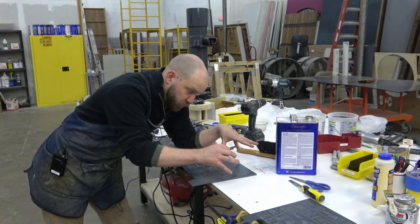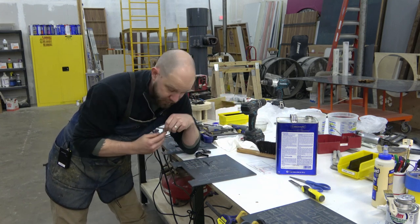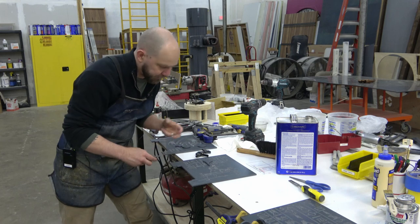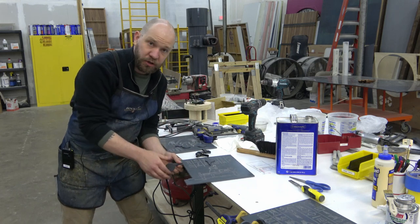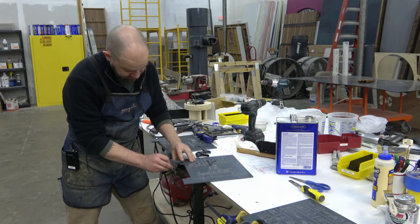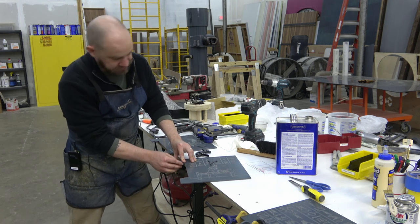Coming back to it — we've got the right kind of hinge and now we're putting it together. My first go-round, I tried to just put on the bottom page, get all the hinges together in the same stack, and get those tacked up, but I couldn't get enough clamping pressure that way. So now I am doing them all independently, just making sure that everything stays nice and flushed in there, and most importantly, vertical to the rest of the piece.